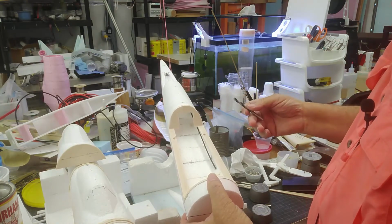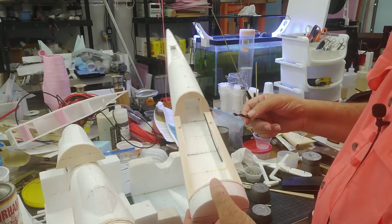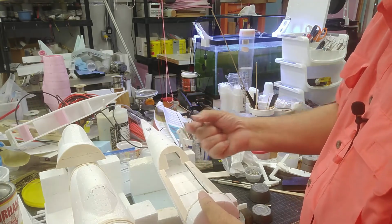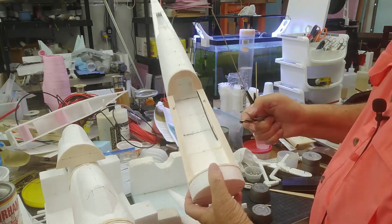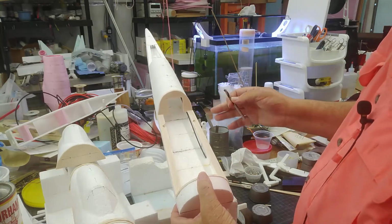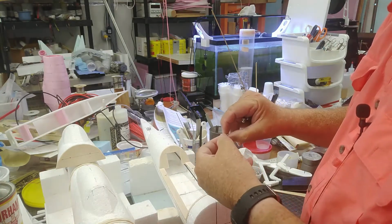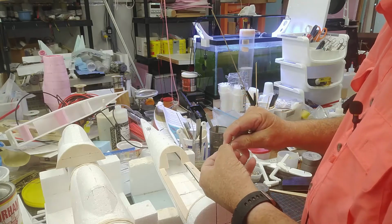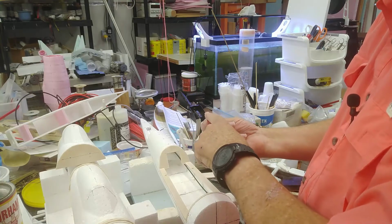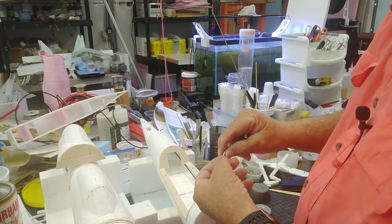We're going to use the small holes here because these are just going to be positioned wherever they're positioned. We're going to use the large holes for the second step, because that allows some wiggle room. You're going to stick it in there with plenty of epoxy around it, and it's going to self-align. And self-alignment is very important, because these magnets, like any other magnets, have a polarity. They have a north and south, and you don't want to put a magnet in where the poles are repelling. So we're going to let them self-align when we put these things in.